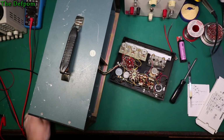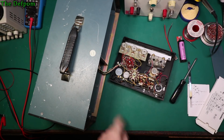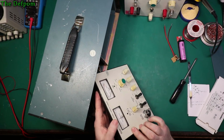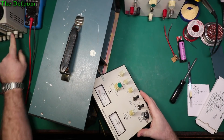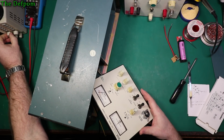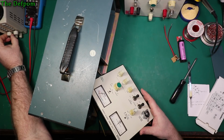June the 4th, 1985. Okay, 1985 is when this thing was made. So 33 years old. Not bad, is it? And it still works. Chuck a 1.2k in there. That should be in between the two, which I think will probably be alright. I suppose I could try it out, shove it in series and see what he thinks of it. Let's try that one again. So yeah, that's in the middle of the range. That looks good. So let's just drop it down. So the threshold there for that bottom of the range is about 3.6, 3.7 volts bottom of that range.